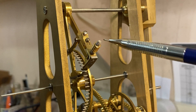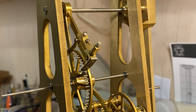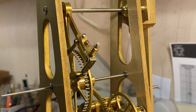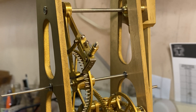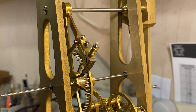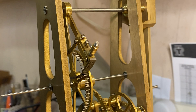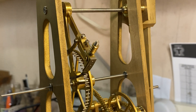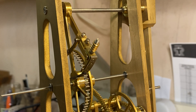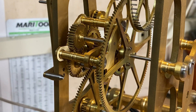You can see there are adjustments on here — weight adjustment, fine adjustments — so you can make sure it engages between those two teeth. I was pleased with how it came out; it seems to work well. But it does make this clock very finicky, making sure that everything is right, because it needs every bit of energy going into that pendulum. This escapement is much more sensitive than your normal anchor escapement that you would see on this type of clock.